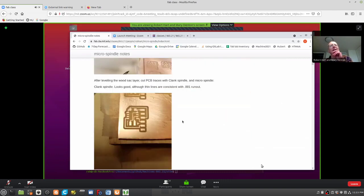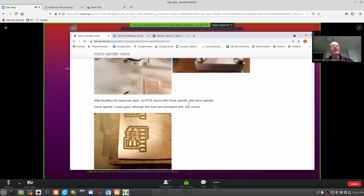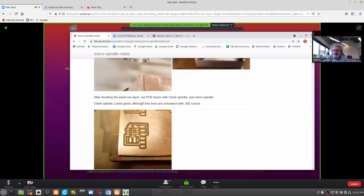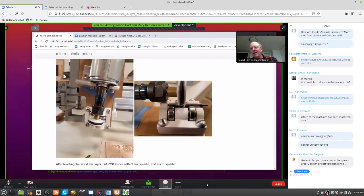You can see it actually cuts pretty nicely. That's not terrible. I'm just driving with an O-ring driver, with the bit jammed in between two O-rings like this. So that's three skate-type bearings, and you push the bit against it and you roll an O-ring? That's right. And I push the driver at an angle so that it's exerting some upward force to keep the bit from flying out. Got it.